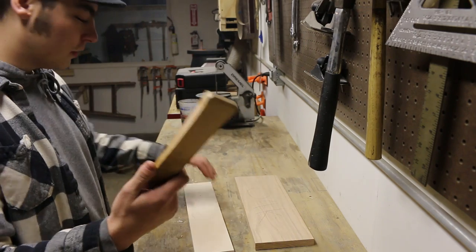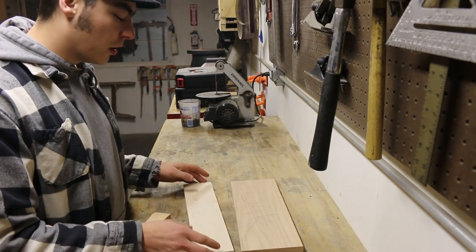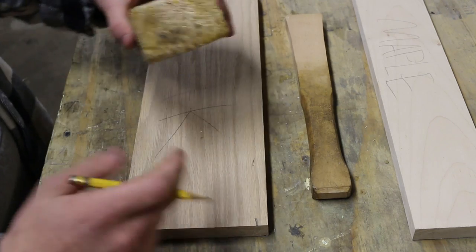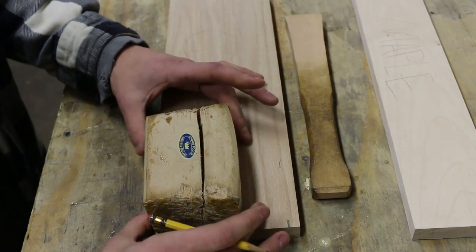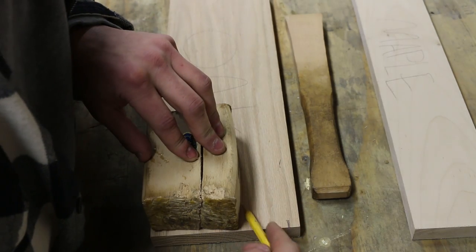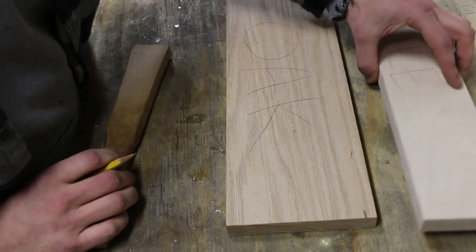My handle is still intact but I think I'm gonna make my own handle. The woods I'm gonna be using for this project are oak and maple. I want to make sure that I have the end grain of the wood to the end of the hammer - it'll absorb a blow a lot better. So let me go ahead and rip this oak down to the height of the current head, then move on to what I'm gonna do with the maple.